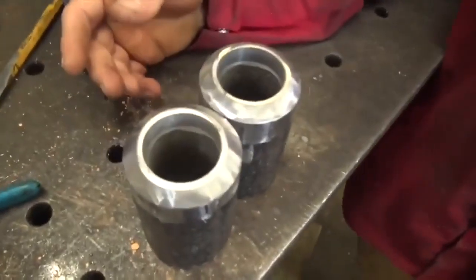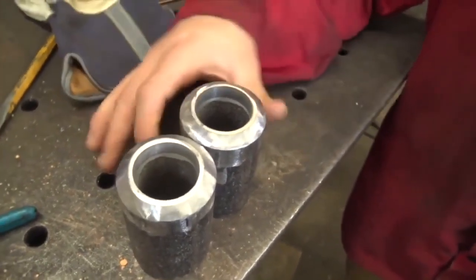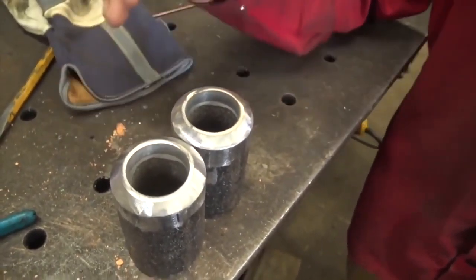This small pipe is not like a 48-inch or 24-inch pipe which is basically like welding in a straight line. We're going to 6010 root this and 7018 cap this in the 2G position so you can get the best view watching the root, the fill passes, and the cap.